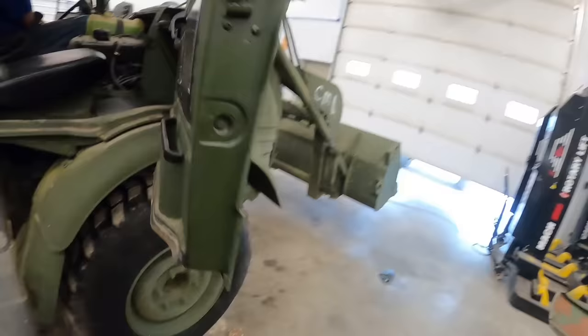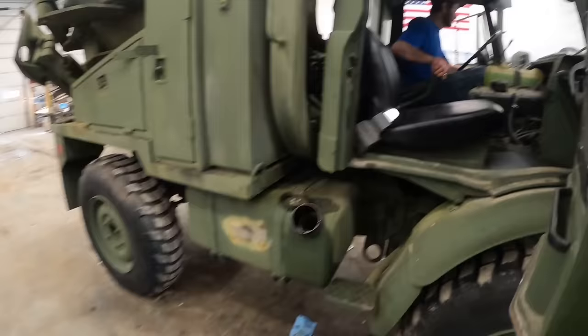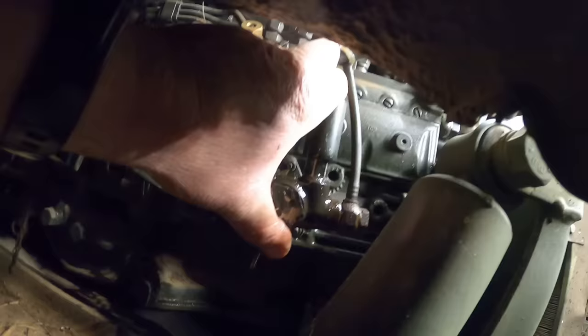All right, here's the problem. This primer pump is shot and leaking over here. Just shut the power off. So, as I told you guys, we've got those primer pumps in stock. And there's a reason why. I'll have to get a light. I don't know if you guys can see that, but that thing's gushing fuel out, which means if fuel's getting out, it's sucking air in. You see that thing squirting fuel out there?